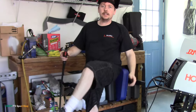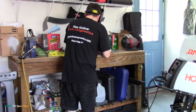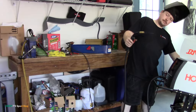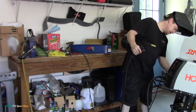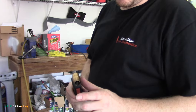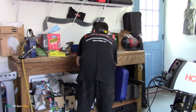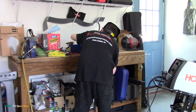Safety third — no jeans, no sleeves, no gloves. That's how I be rolling. Don't forget to purge your gas. We got gas. If you don't purge your gas, that first five seconds of welding is going to weld like shit because it won't have any shielding gas. So always purge your gas.